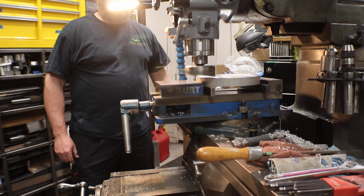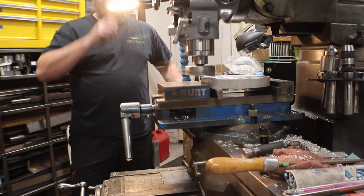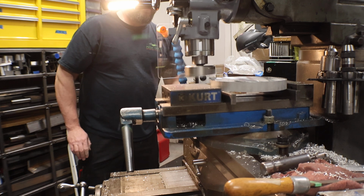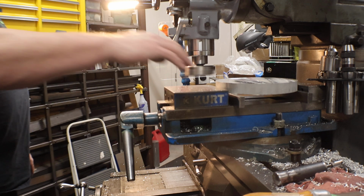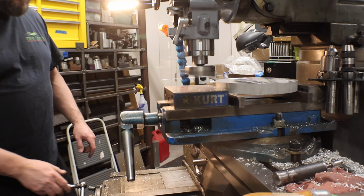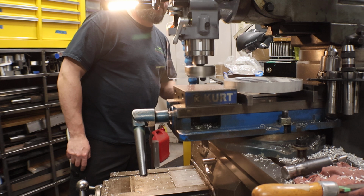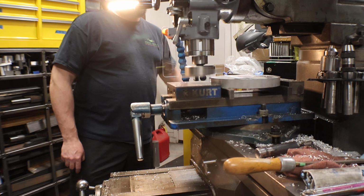So essentially I just need to get a good backside for this aluminum plate, and then when I flip it, I put in that bolt pattern, counter bore where the bolts go, and then I'll do the facing on the lathe. Now when I just cut that previous pass, I noticed that it cuts better going towards me, so I'm going to go through the trouble, I think. Let's see, where do we end up? Let's see how this goes. I'm thinking out loud.